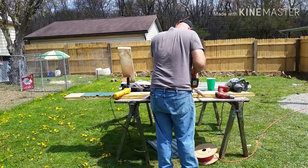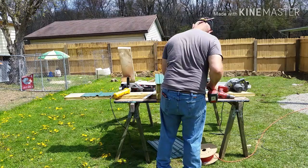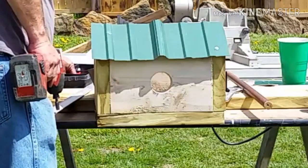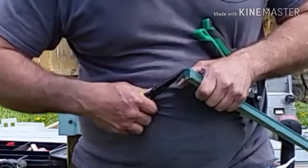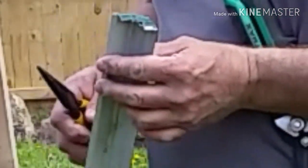A couple of quarter-inch metal roof screws will hold it right down in place. Because of the small dimensions, we'll custom-build a ridge cap — cutting the ridge from a scrap piece of metal and bending the ends over so there are no sharp points. It's also more aesthetically pleasing bent down like that. The roof is complete.